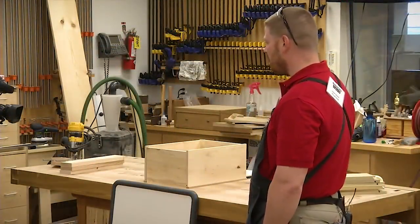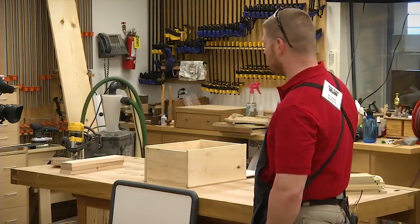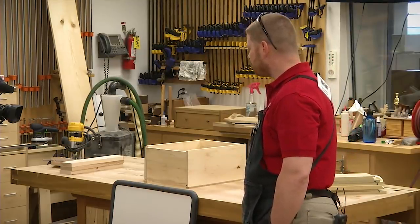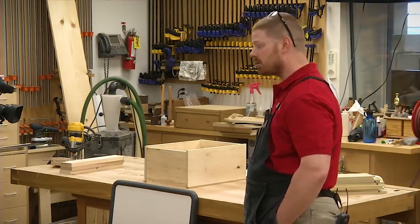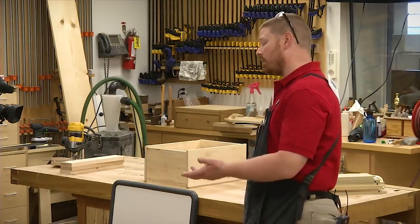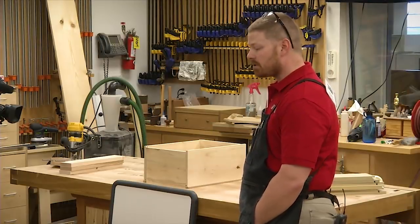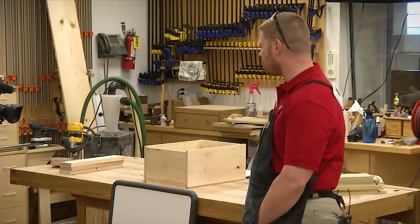I'll use almost anything. People think I'm crazy, but I'll use quarter sawn oak for the sides of drawers. It makes a very strong drawer, a very heavy drawer, but it's also very stable. The classic that you see everybody use everywhere is poplar, and nothing wrong with poplar. I think the big reason they use poplar is because it's relatively stable and it grows on trees. It's pretty cheap. You'll see pine in cabinetry anymore. You see a lot of soft maple go into drawer parts.